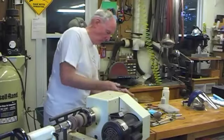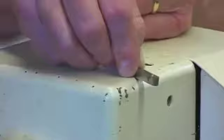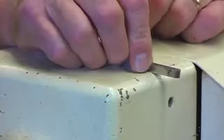Take them out. Put them on the platform of the grinding wheel and just sharpen it. Right? You know, until you see the burr come, the sparks come over the top. Then you know you had it. Right?